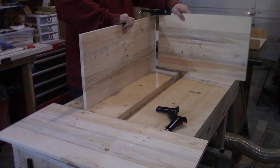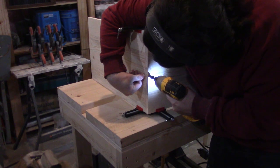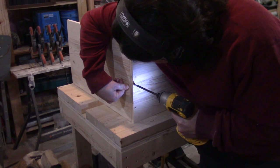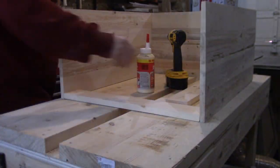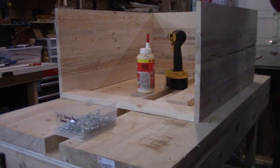And with that done, it's time for assembly. I pull the right angle clamps out of the drawer and start screwing the panels together — no pocket holes today, I'm just going straight through, still gluing the joints though. To keep the front side from flexing out too far, I'm installing these cross braces, which are just off cuts of pallet wood from my batleth project.